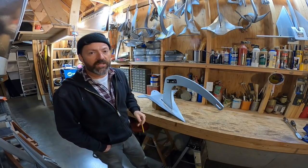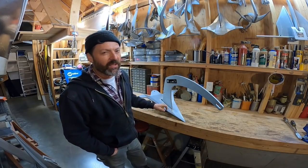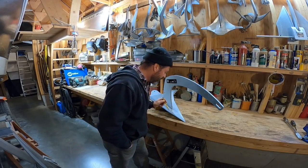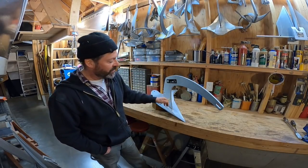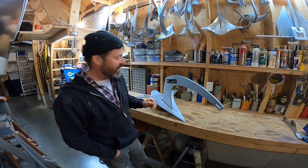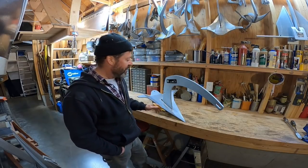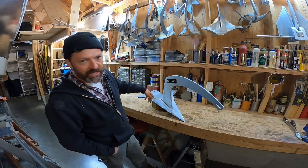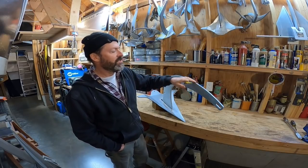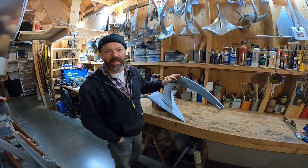The anchor received a thorough jostling in my cobblestone seabed test — that's the test where galvanizing problems show up — and I can report that only one spot has a piece of galvanizing missing, right there on the fluke. It seemed like there might have been a glob of something under the galvanizing. Everywhere else, all the leading edges are intact. Part of the success is likely due to the well-chamfered corners all over the anchor. There's not one place where there's a hard edge corner.